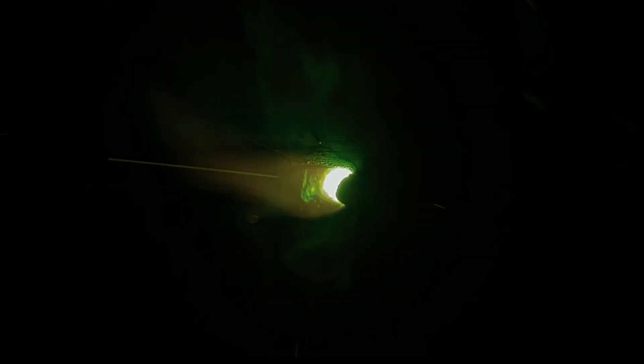Let's watch this arc footage. The molten puddle ends about double the rod width away from where the rod is. You can see that edge that is bubbling, and then nothing behind it — that's the edge of the molten puddle. I'm just dragging it along so it stays equal in width and height.